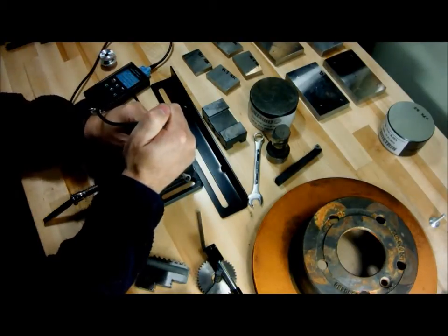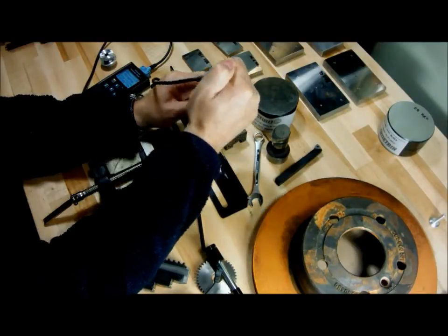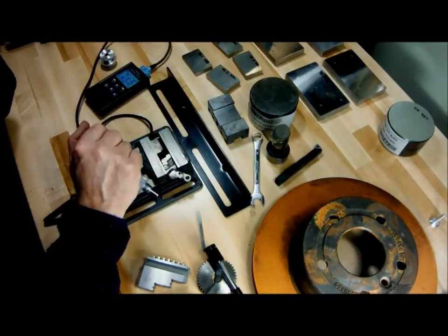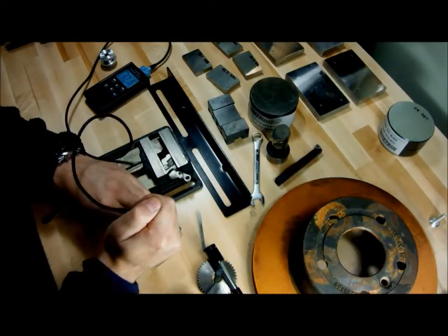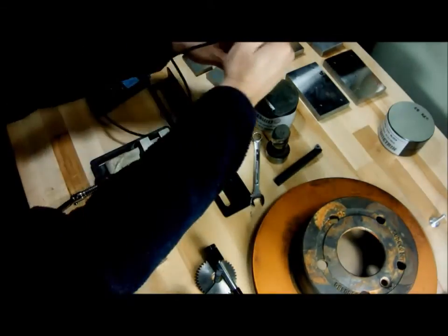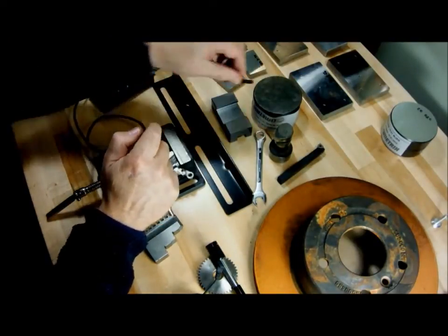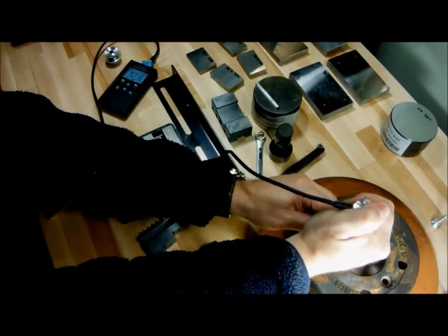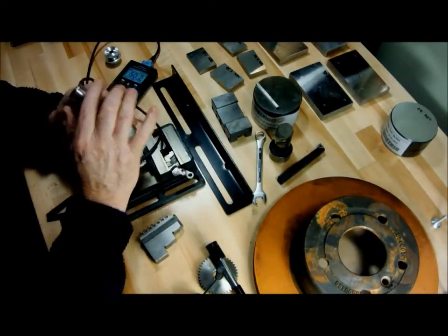I'm just going to test right on the part — and there is the hardness. I can test this piece too, and there is its hardness. You can see almost imperceptible is the little depression that's left, so we can truly call this non-destructive testing. I can even test the face of the vice, I can test this part — no problem at all. I can even test this little thin piece. If I put it over a material that was harder and could support it well — because this is a machined surface sitting very neatly on this one — I can do hardness testing against it. Even on this part here I don't need to support it; I can measure it. And you can see it is a very, very accurate kind of device.